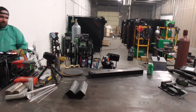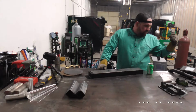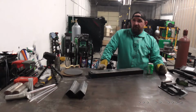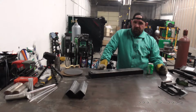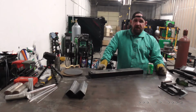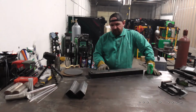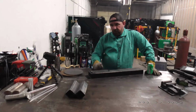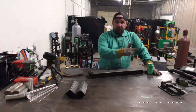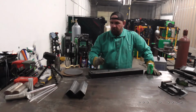Yeah, they are expensive. They're coming down. Like I said, this is a 1500 watt unit. We've got a 750 watt unit. I think they're going to retail for right around, Oleg will kill me if I misquote, $5,000, $5,600, something like that for the 750 watt. That'll weld 1/16 material, and obviously we're using 50 watts here, so it'll do all the cleaning you'd ever want to do.